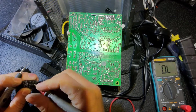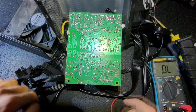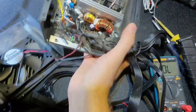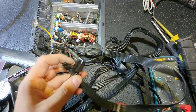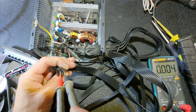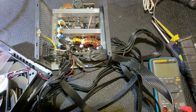The primary side is looking good, so let's check the secondary. And it is a short on the secondary. I should have done it right at the beginning before even opening the power supply — that was my mistake. Don't repeat my mistake: check the outputs right there at the beginning. Anyway, let's confirm one more time that there is a short — and there is.